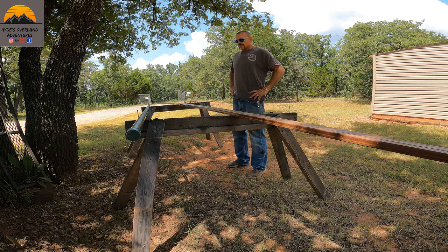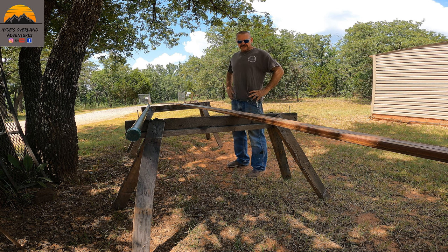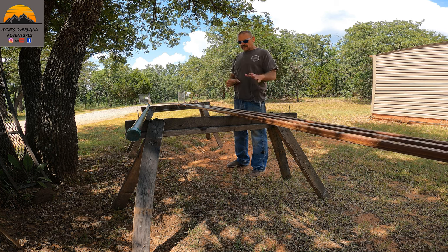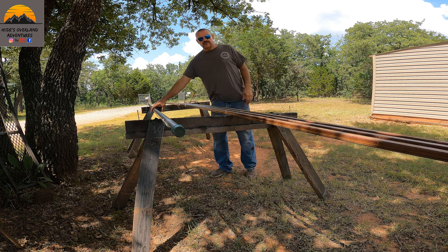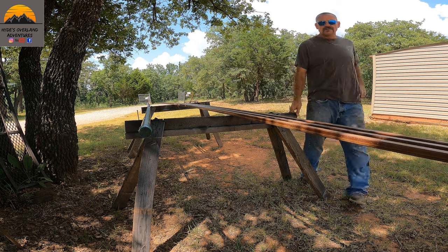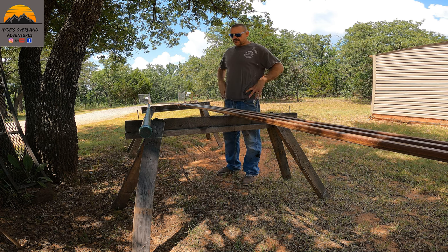I'm not going to make too many shows on it. I'm hoping to get it in two episodes. So what we got here is some one inch square tubing — we're going to make our arms out of that. The arms are going to be almost eight foot; I'm going to cut them eight foot. We may have to cut them back a little bit. And we've got some one inch pipe here, and also some bearings and some plate steel for the brackets and the pivot arms.